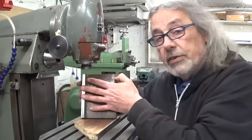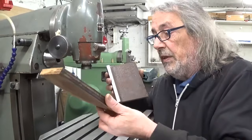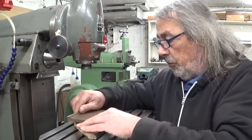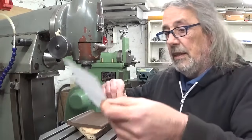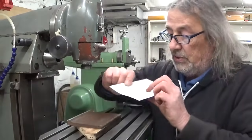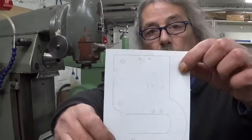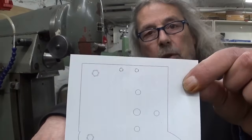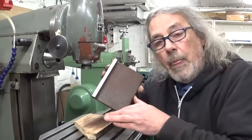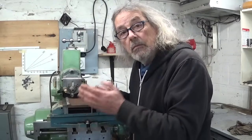I can put it here and it will be an easy check. Now, to install my part here on the milling machine, I will use a piece of very precise wood. Well, I will check if it's precise or not, and then put the thing on here like this and bolt it down, and I will drill a hole the width of the slots in the table, of course. One hole here where thereafter there will be nothing, and one hole here somewhere also where thereafter there will be nothing. But before I do that, first I will cut off this rim on the shaper, because the shaper will be much faster to do this than the milling machine.